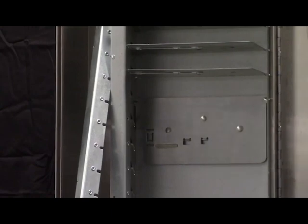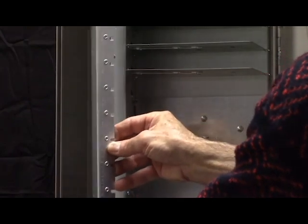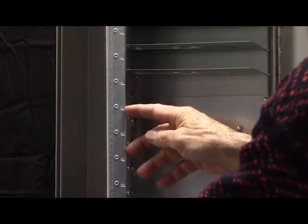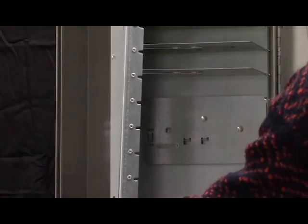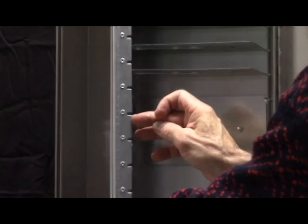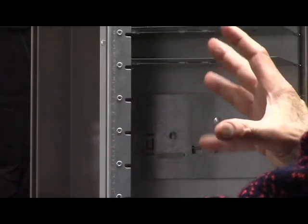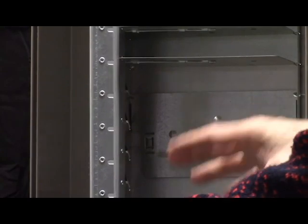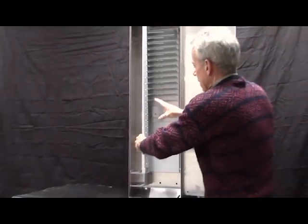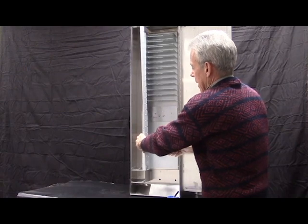The latch bar — this area below the notch — is where the latch wire for the shelf will come up and rub against before it snaps and then resets. The wear area and the metal-on-metal is right here below each of these. Over time, talking to so many different car washes, we've noticed that operators tend to use certain areas in the machine over and over — doing 10, 12, 15 of them repeatedly. These are the areas that really get raw over time.